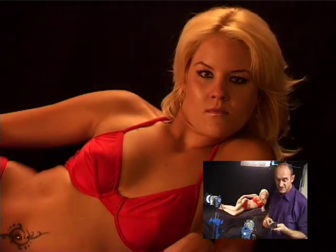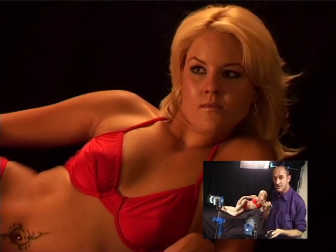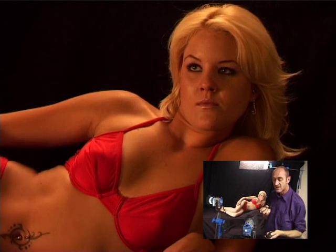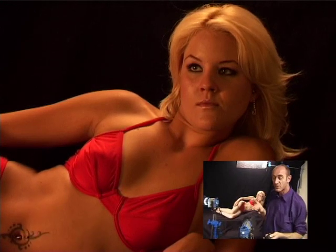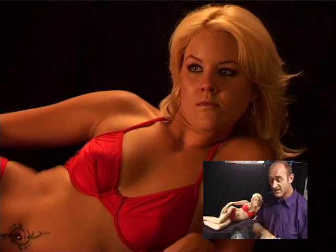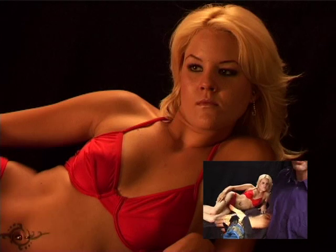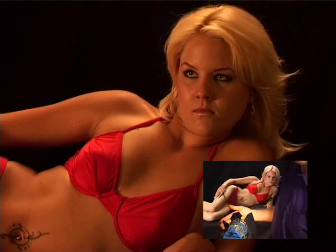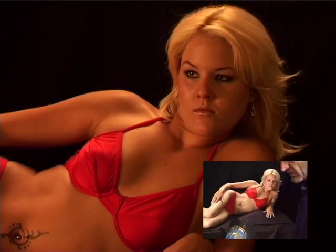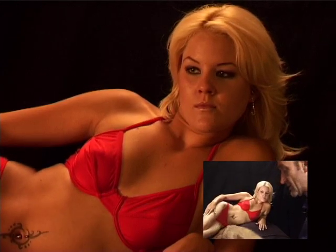Problem with these lights is on the dimmer, if you go too low down, you're actually getting a very low color, very orange out of the light, instead of coming up to the normal white. These are all 3200, these are all tungsten lights. But way down on the dimmer, this becomes a very orange light. 2400 Kelvin, not 3200. Okay, let me set that, just for those eyes.